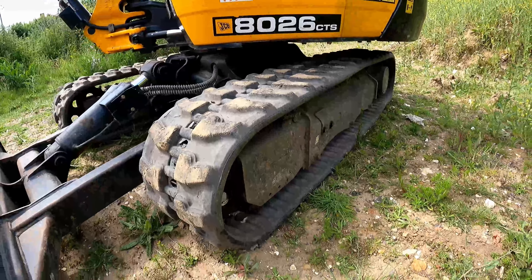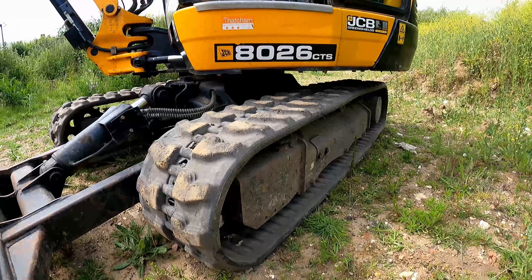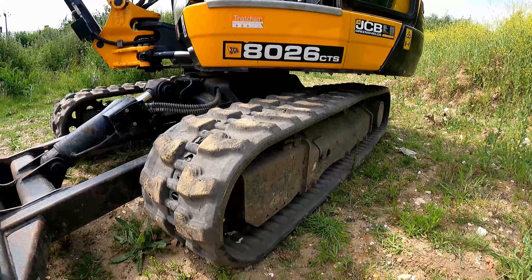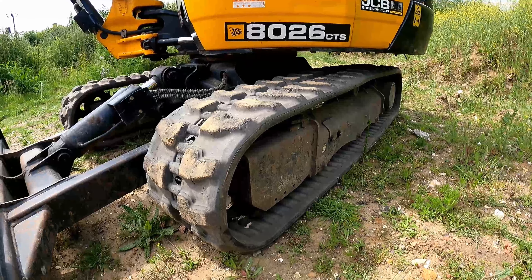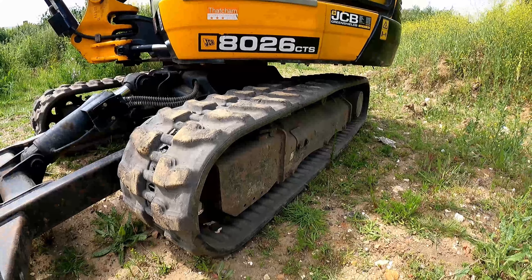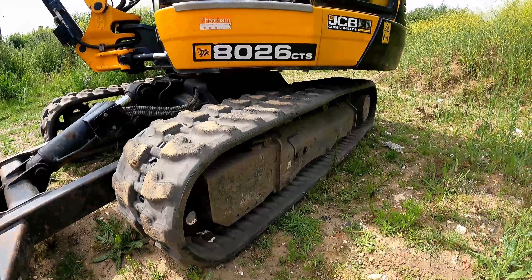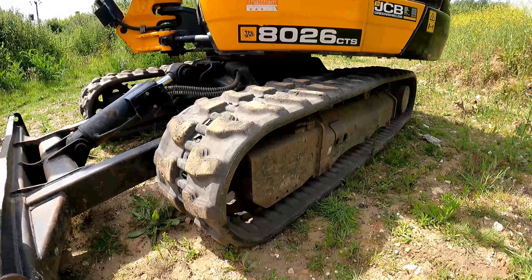You can see the track is made of these wires here that run all the way around — the whole track. They had got fatigued. That can happen through having cuts in the track: the water gets in, they rust, you start breaking a few and you've got a weak point. So the track was being held under tension because there's excess dirt in it and it just basically exploded — gave up. Some of which you can see had frayed and some had rusted previously.